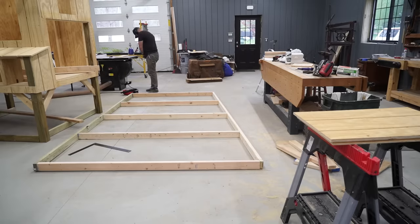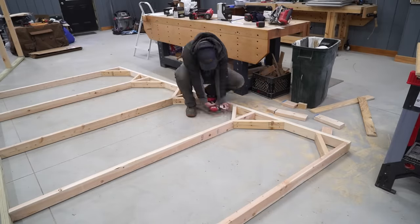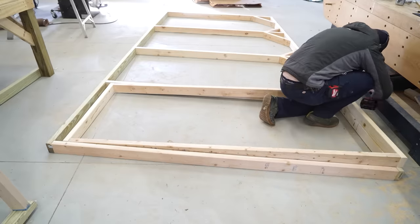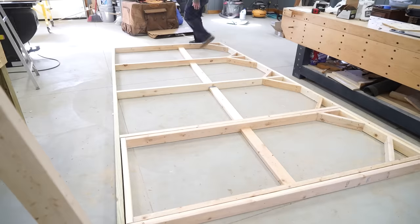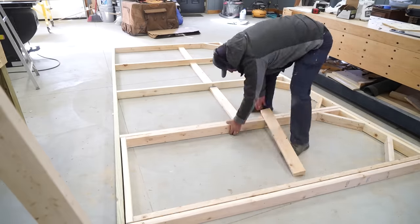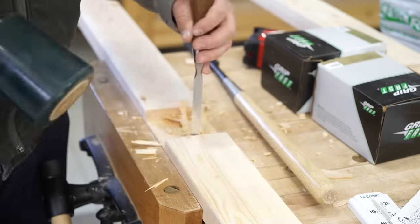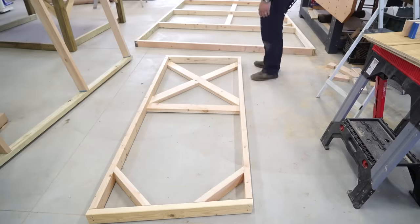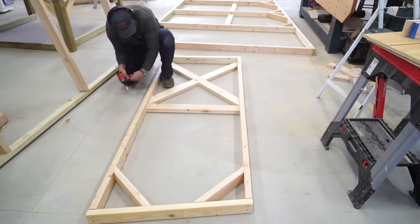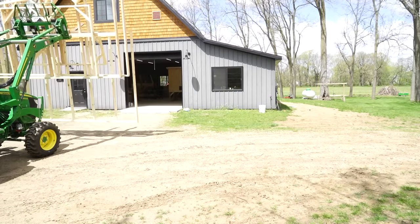I'm going to use three-foot spacing on my 12-foot long run and add angled bracing to add rigidity against racking. With a 12-foot long run and the roof pitch angle I'm using, a six-foot-tall person can comfortably walk in the far end of that run. If you want to make it longer you give the chickens more room, but just remember it will slowly start getting shorter and shorter toward the back. I make a door that is an inch shorter and narrower than the opening, and then I'll add horizontal nailers all the way across all my walls so I'll have a place to secure and overlap the four-foot-tall hardware cloth. Using a half-lap joint I make an X that I'm going to secure inside the door to help prevent the door from sagging over time. Now that all my pieces are made I can take them outside ready for painting and assembly.